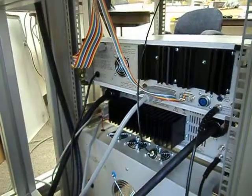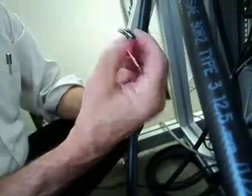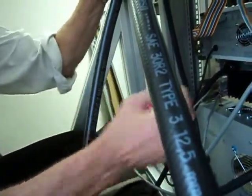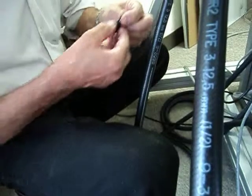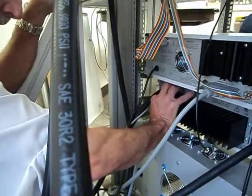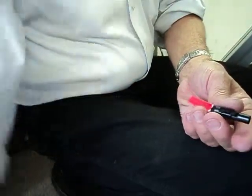We have a jumper in here temporarily — this is a temporary jumper so I can make this run without water flow. We can give you one of these for the installation, but do not leave it with the customer because they will burn up the coils running it without water. We can give you one as a spare. To remove it, push down on this little plastic tab and pull it out. The water flow switch connector goes only one way — it's keyed flat so it'll only plug in one way.